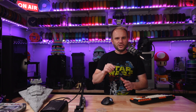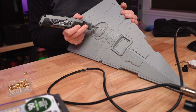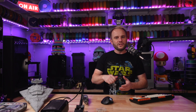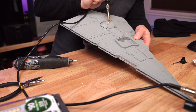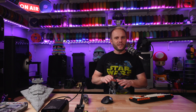Normally there's an opening in the print that matches the size of the insert when it's designed for them. But because this is custom, I just used my Dremel and opened up a hole just a little bit smaller than the size of the insert. Just like any heat set inserts, they are pretty easy to install — just a little heat from the soldering iron and some downward pressure, and they slide right in. Once it cools and the plastic sets, we can simply attach them to anything that uses quarter-20 threads and position it for filming. This makes it so much nicer to position the model and then move lighting and cameras around to get the shot we want.